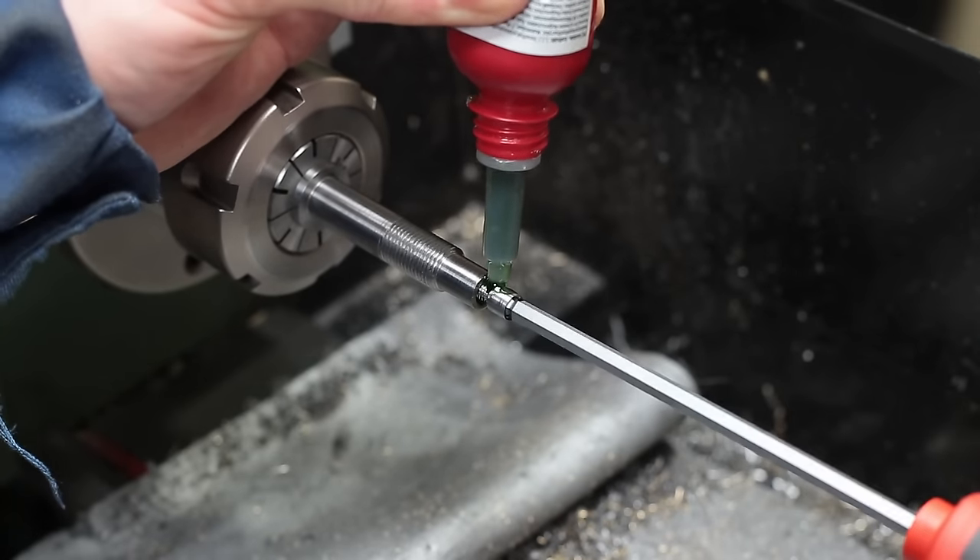And now to the second part of the nut — it is made out of a smaller bar stock of brass. Speaking of brass, this is not the ideal material for a lead screw nut. You normally would use bronze on these parts as it has better gliding properties. As I had no bronze on hand, it's a good excuse to make a second video on making a bronze nut in the future. Of course this part needs the internal Acme thread too. As this part is way shorter than the previous one, the cutting process was a lot easier — again pretty crunchy, but it felt way less violent than on the first part.